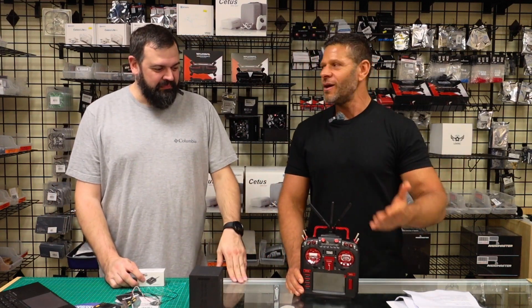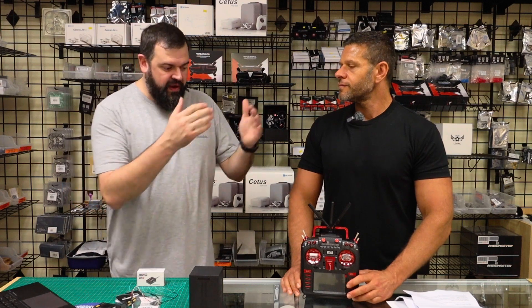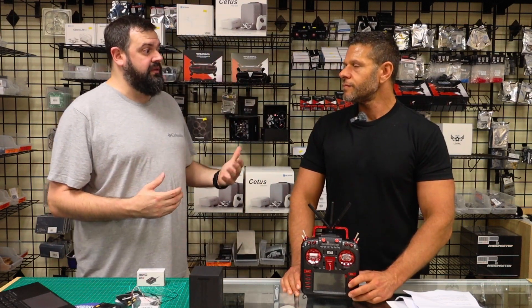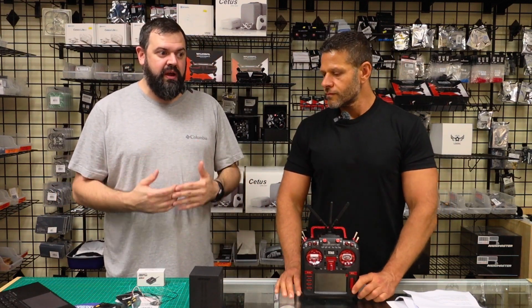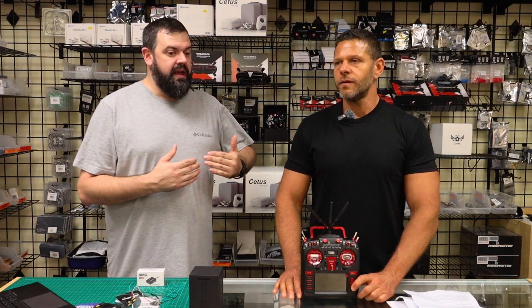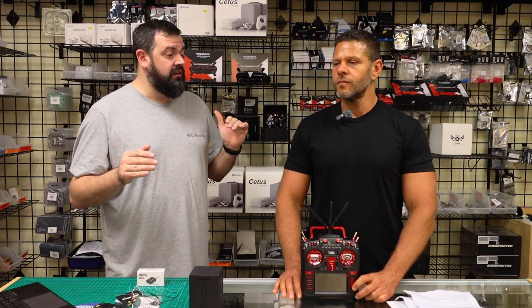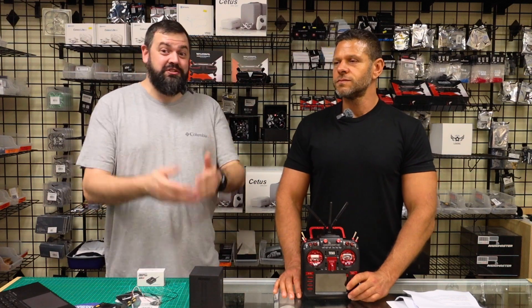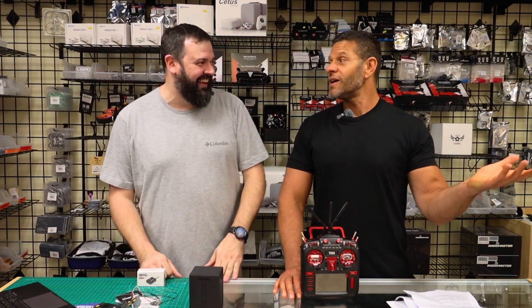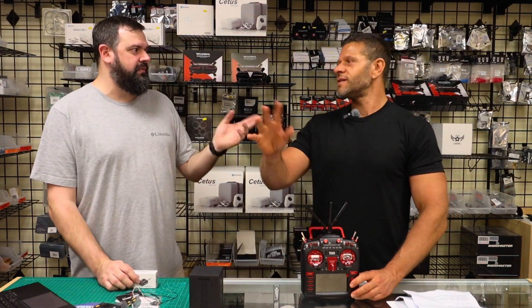You have to create solutions before the problems exist. From customer support emails, signal loss isn't a repetitive complaint. But if you don't have an ELRS module and you're looking to get into ELRS — say you have a Radio Master TX16 four-in-one and want to try ELRS — the Nomad module would be a great purchase because it's only a couple bucks more than a regular ELRS module. It has extra capability: if you're having 2.4 issues all day, you can switch to 900 megahertz, or if you accidentally bought the wrong ELRS receiver you can run one or the other.